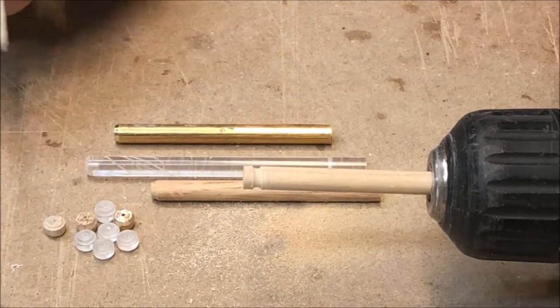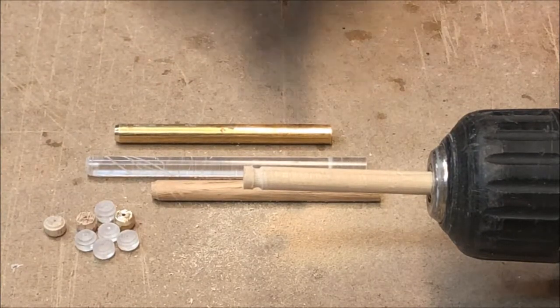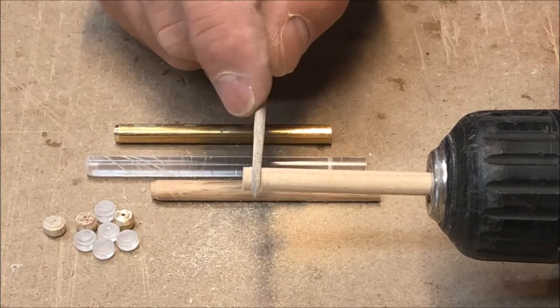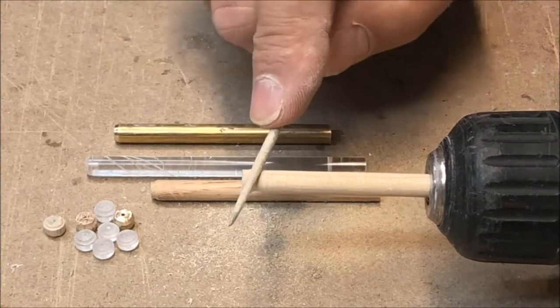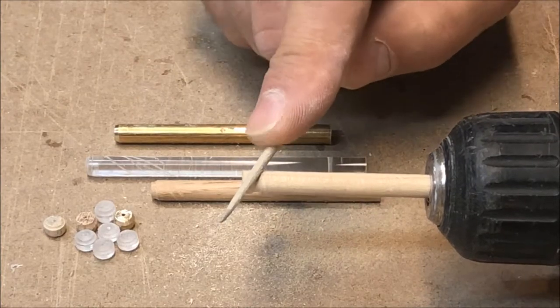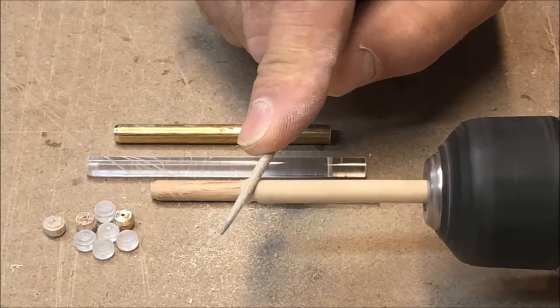The depth of my groove is about a third of the material. I've discovered that I like to have a little more gentle slope on my curved profile, so the way that I do that is I'll turn my file to an angle and it'll broaden that trough.